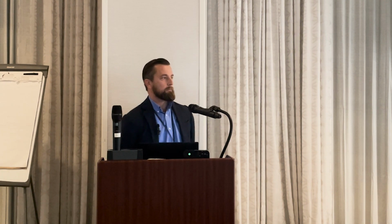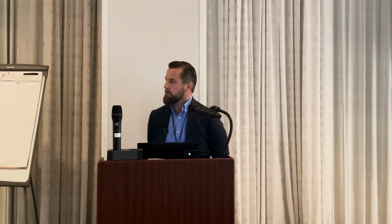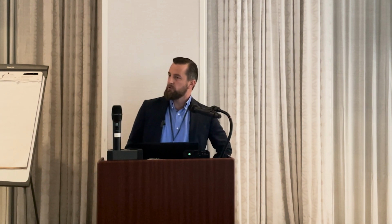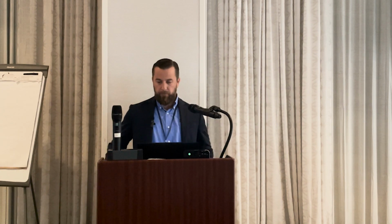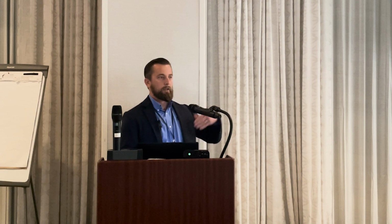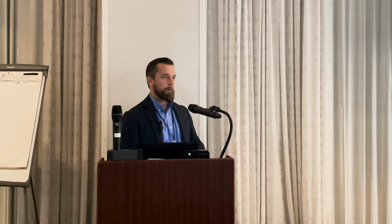The length of the laminate is usually very forgiving. If you know anything about FRP properties and strengths of joints and secondary bond shear, the length is actually very, very forgiving. So that's why having a little bit of edge peel is usually not the end of the world for your joint, because there's usually minimum joint length, and it's usually very, very conservative for what the actual bond shear stress is. It's more important about the thickness and eliminating any type of peel or any type of bending.